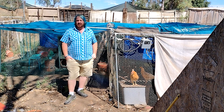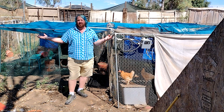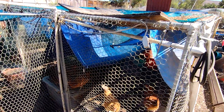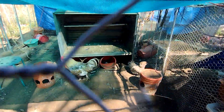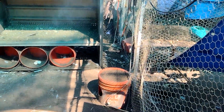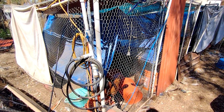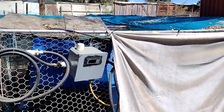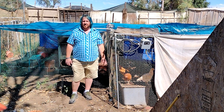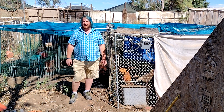Hello and welcome to the JK Feather Ranch channel. Today we're going to focus on the actual ranch part — I'm back here at our chicken coops where it is over a hundred degrees today, so they definitely need some cooling. We installed this mister system here and we used to get by just controlling it with this valve — coming out in the morning to turn things on and back in the evening to turn them off. But that gets annoying, so I put together this box which contains a thermostat and an electronic valve that automatically turns the misters on when it gets hot and off when it cools back down.